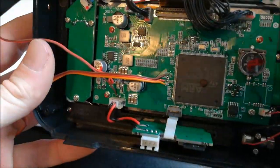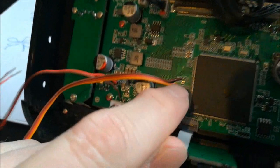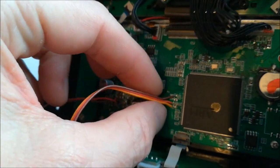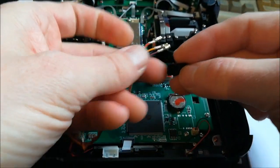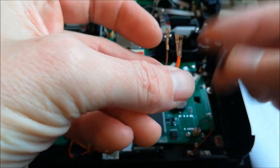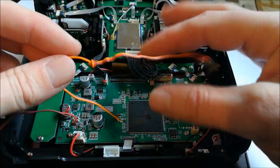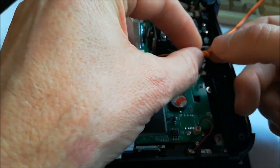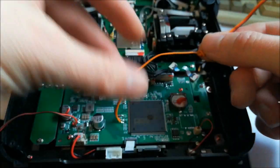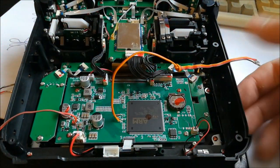What you need to do is get your wire and solder it to the proper locations. If you get the order incorrect, don't worry — you can change the order at the connector end by swapping the individual wires in the header to get the correct arrangement. One important thing: use long enough cables, and make a strain-relief knot inside the case. This is really important — when you pull on the wire from outside, you're not pulling on the solder joints.